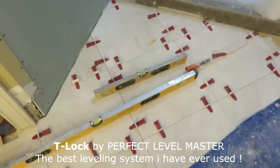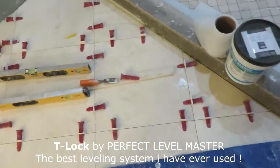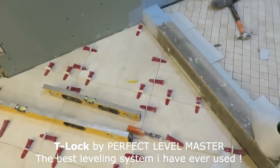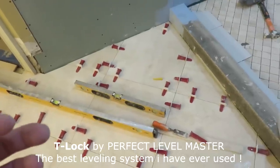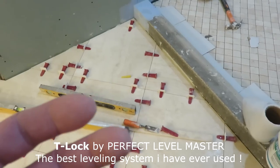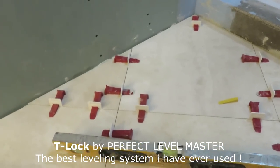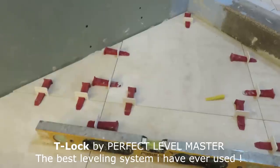Okay, so I'm through with the section over here. It was a pretty challenging section because those corner cuts are always difficult to insert, because most of them are a one-time installation. Once we set them in thinset, we have very little chance to actually remove them once the thinset catches them. So often if you have a situation where you have to remove a tile or lift it, and it's hard to do so, breaking it is the only way to do it.